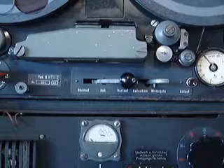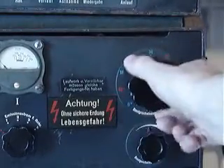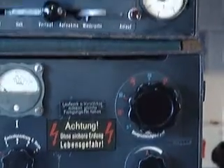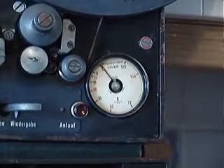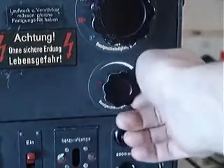Once you take your finger off it, it then starts to slow down in speed. Once you've got it running to more or less the speed you want, select it by this controller here. To get the correct speed out of it, you'd need to gauge it by the capstan tachometer there, and then using the fine adjust, set the preset levels.